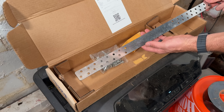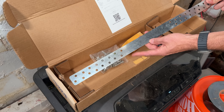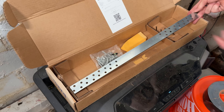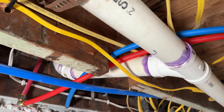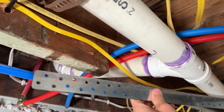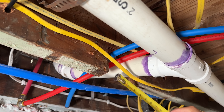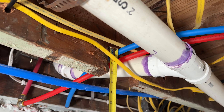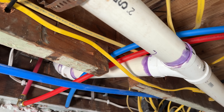Make sure you're drilling your pilot holes. Let me show you what size of notch this fits and what alternative you might have for a larger notch. First, measure the width of your notch. Here I have a five-inch wide notch and the smaller of the two straps — a 24-inch strap — can go up to six inches wide, as long as you have at least two inches on the top side of your notch. I have about four inches, so that's plenty.